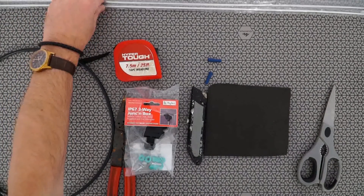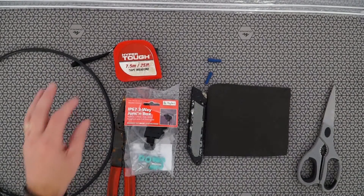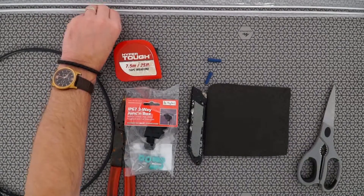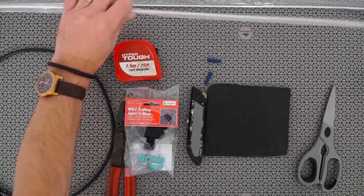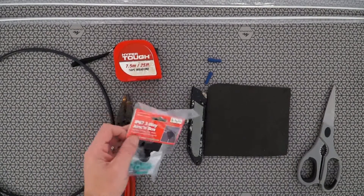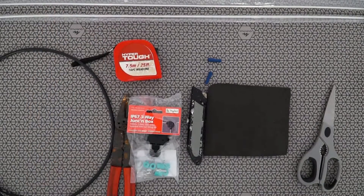I'm in the UK, so I buy these from Screwfix Direct. I'm going to build a civil air dipole based around 127.5MHz, so we need two of these rods. If we're building one over around 140MHz, you could get away with one. To build this without the coax, it's under £14. If you bought two at £8.29 each and two rods, you could actually make a civil air dipole and a military air dipole.